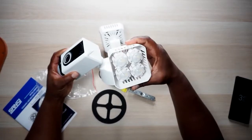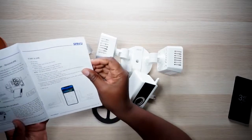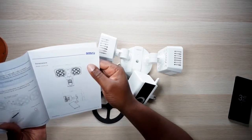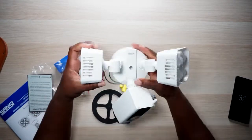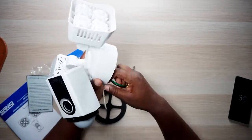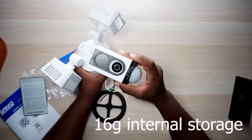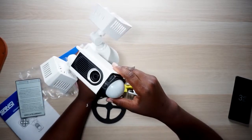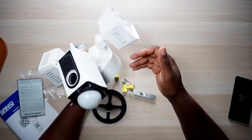All right, let's take a look around. We have four LEDs on each side — I think it's like 30 watts or something crazy. These Sansi lights are bright; you really cannot look at them directly. It's like looking at the sun. Four LEDs on each side, so that's a total of eight. Your patio, your house, your garage is gonna be lit. You got your wires on this side — your ground, your neutral, and your hot. You got your little antenna right there, reset button, and there's your little eyeball for your camera. That's the speaker, because you can actually talk through this thing. And right here, this must be your ambient light sensor. Without further ado, let's just get outside and plug this thing up and see how it works.